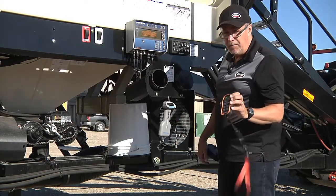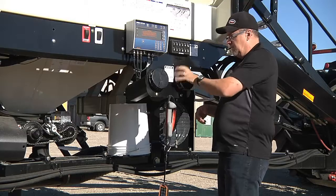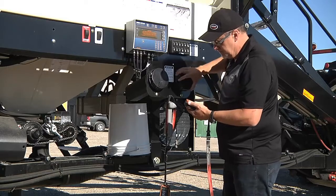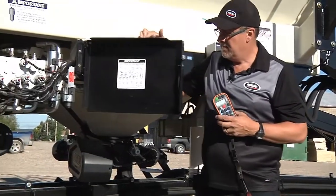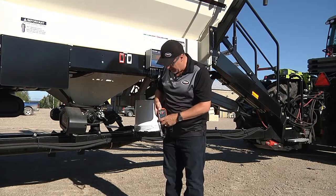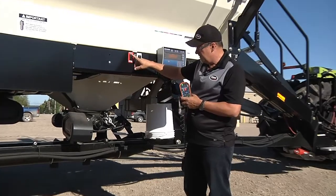This tank is equipped with a bulk boom, so we have a remote for it. In the other holder you could have your operator's manual, but we have the remote in that one. This remote links up with the hydraulic valve via a receiver located in behind. As safety permits, we don't have this remote live — I'll turn it on. The conveyor run switch powers up the receiver.